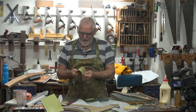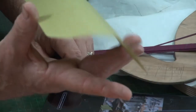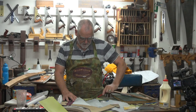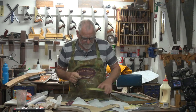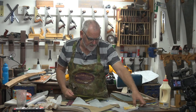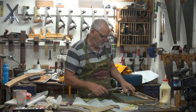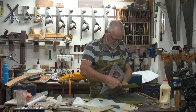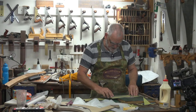Same material, and find out which is the downside. The downside will bend like that without splitting. The upside, you won't get as much bend out of it. So have the downside up, hit it with pencil, do it again, downside, pencil. Now, to get the variation in that pattern, not all the grains go in the same way. So the green one, I'm actually cutting at an angle of 60 degrees, much like what I did before. Let's see, go that way, that way. That one goes, okay. So get your 60 degree angle.